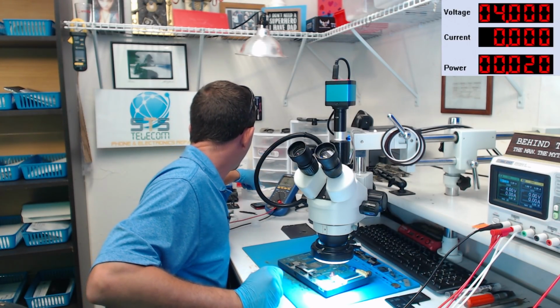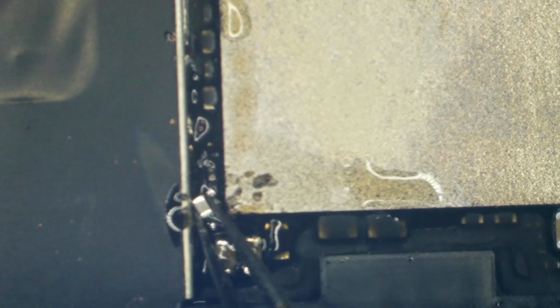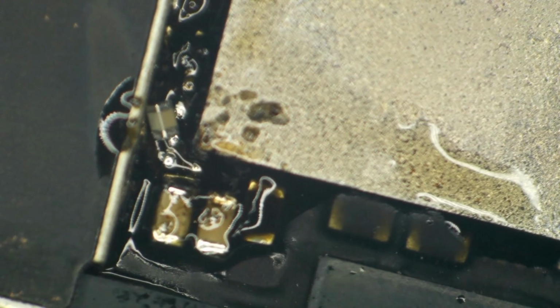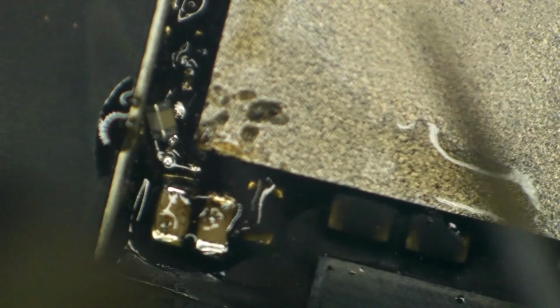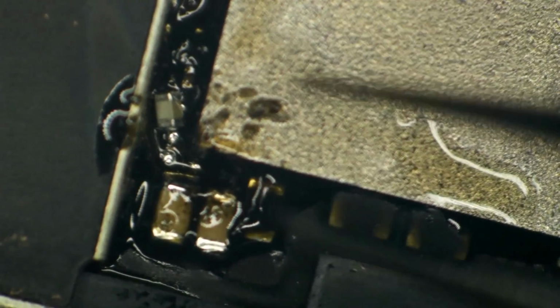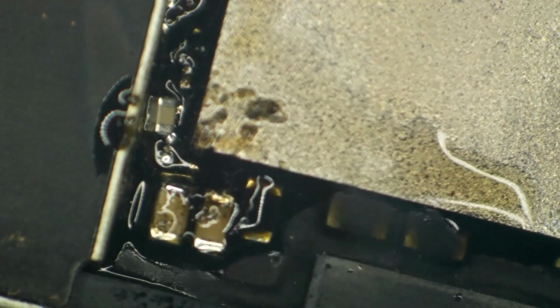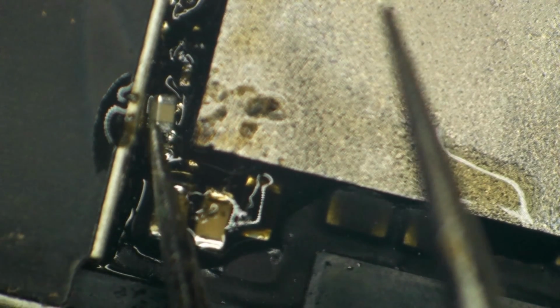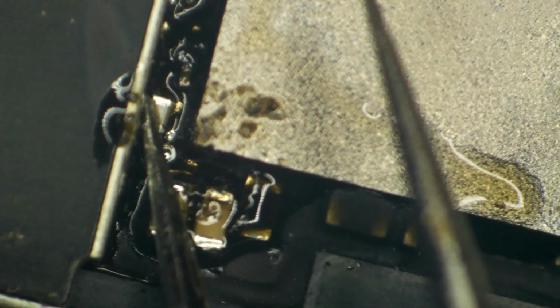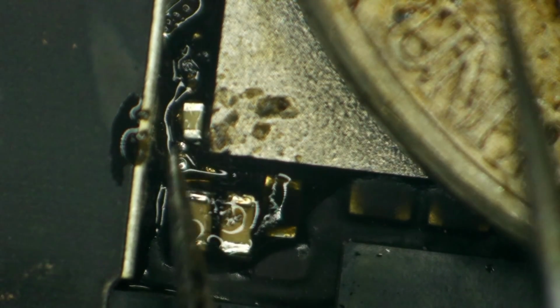Next, we need us a brand spanking new capacitor. There we go. So that capacitor is going to sit just down in there just like that. And because I'm feeling maybe somewhat lazy today, maybe somewhat not wanting to get down in there with my micro pencil, I'm just going to go ahead and solder this thing down with hot air today. So I have 63/37 leaded solder here on the pads, which is going to enable this component to float into place before everything else around it melts. There we go. Now, as this cap warms up, it's going to want to shimmy into place, I hope.